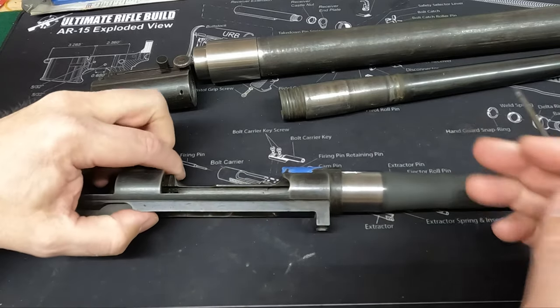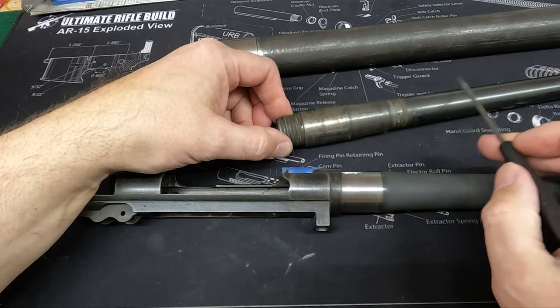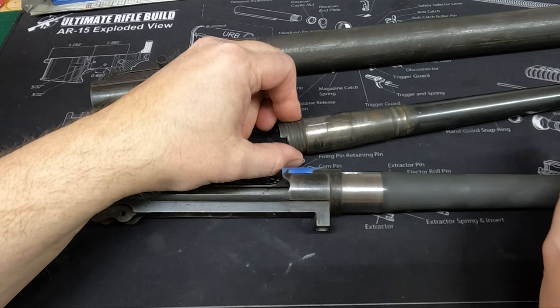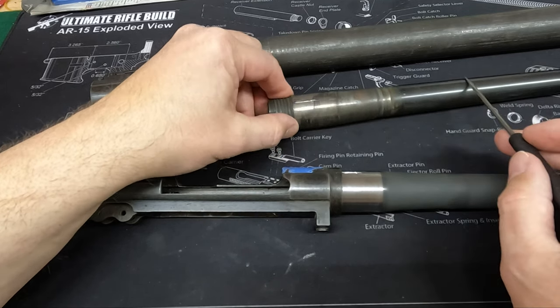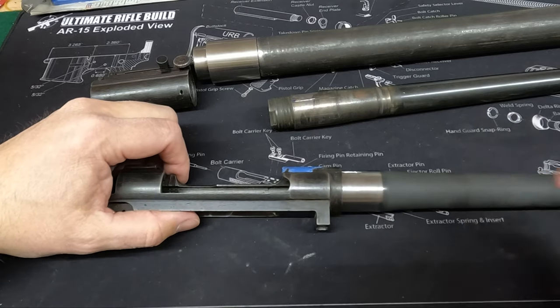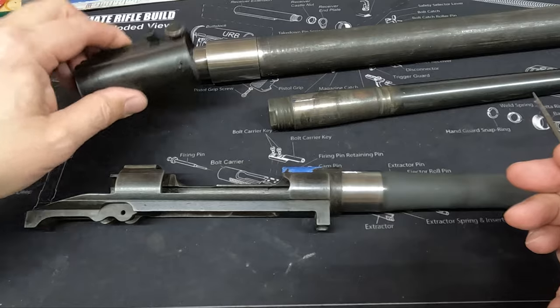And so we had to change the barrel. If you've seen the initial series of this, the original barrel was extremely, badly pitted, so we need to change the barrel out. This is a new Criterion barrel. We've had to do several things to it, including cleaning up this diameter a little bit so the sight collar would actually fit over it.